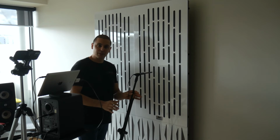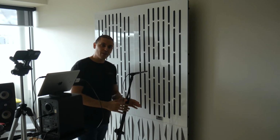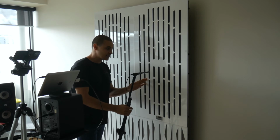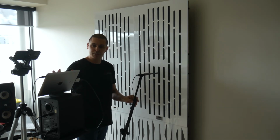And you find, for example, from the analysis of the stereo setup, you have a big peak on this frequency, and you test these absorbers, you can reduce up to 20 decibel just with one panel on that frequency. That's a massive absorption.